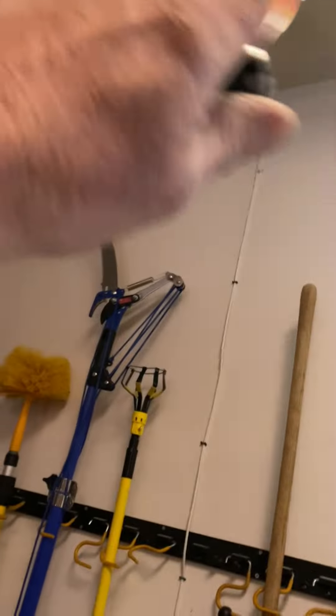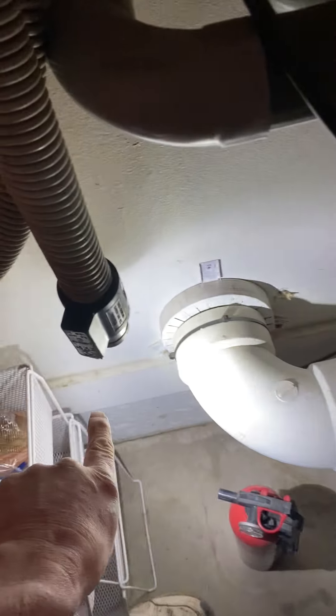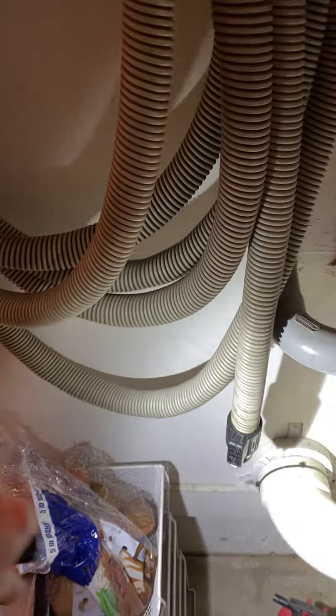I'm going to take a 90 into this fur-down space. I furred this down because I've got a drain over here and a drain over here. This one you can probably go under it or over it — you have room to get in there. Drill your holes over here at the end — two three inch holes — then come down the wall here where the vacuum hose is, and go through behind the return air duct. Work all that in from inside the duct, cut your hole, go behind the furnace, and maybe come out between the filter box and the furnace.